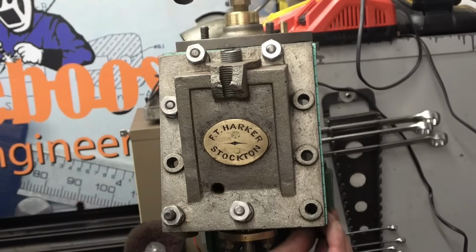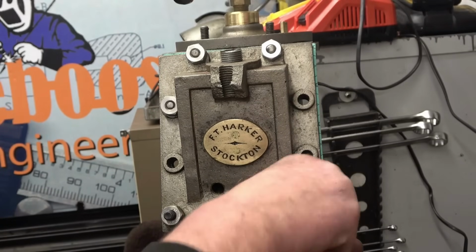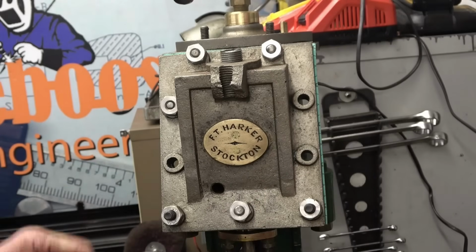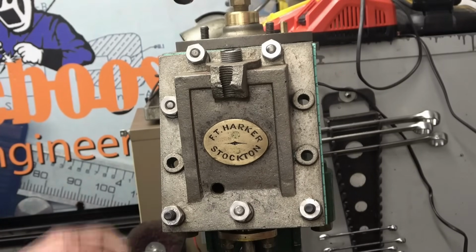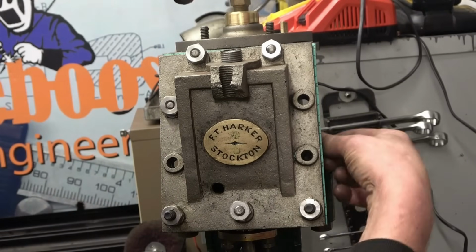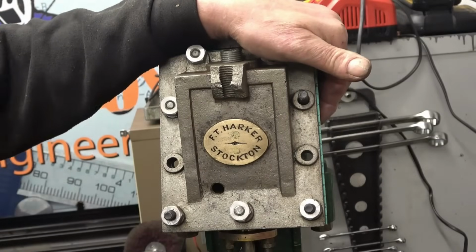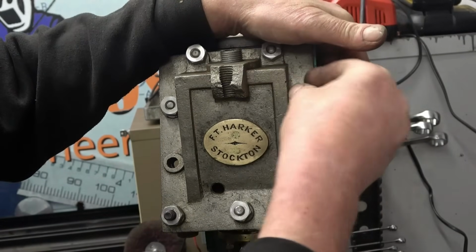Some of these go through without having the heads modified. Some of them will need the heads modified to clear the cylinder. Put the nuts on there, I'll mark them to length and I'll shorten them in the lathe and round the ends off. Yeah, these ones need the bolts modifying, that one doesn't. Possibly only the two that need doing.